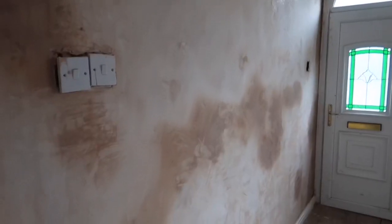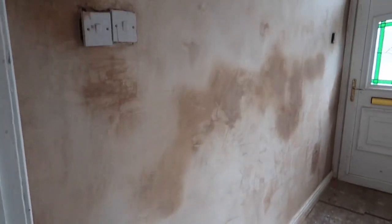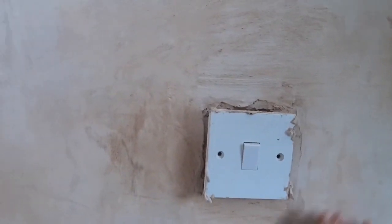I've left this drying over the weekend and it looks pretty good. I'm quite impressed with myself - by no means perfect, but I think for my first attempt I've done really, really well. There's still a little bit that needs to dry on here, and there've been a few bits that are quite rough, but I've been able to go over with a bit of sandpaper and it does smooth it out. It's not perfect around here, but hopefully with sanding down that should be okay. There are a few trowel scratches up at the top and maybe a couple of bits I might have to go in with a little bit of filler just to even out. All in all, I am really happy with this. I'm going to crack on now and get the rest of the room done.